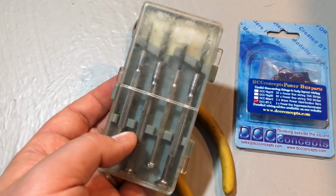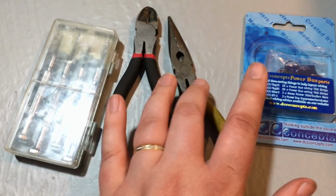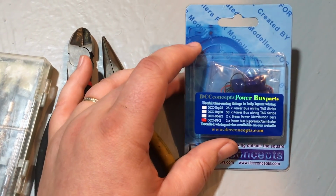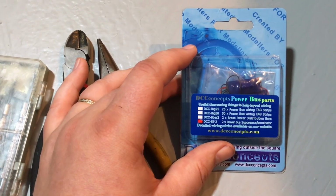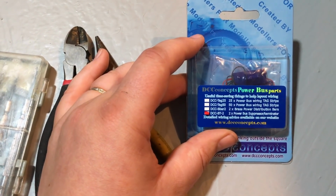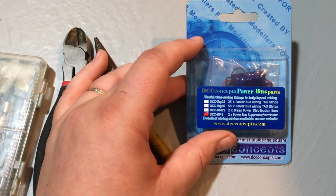So I'm also going to need a jeweler's screwdriver to get underneath there, just to open up the chock block, get the wire in and close it up again. One word of warning on these is that in normal operation they do get warm, about 65 degrees warm, so they will actually be unpleasantly hot to the touch. That means they're working. But it does mean don't bury these away, tucked away in something that it'll melt or char. They need some good airspace around them.